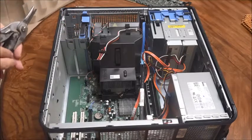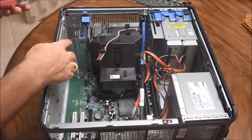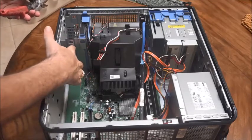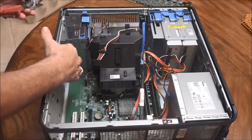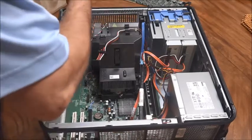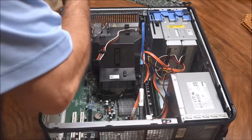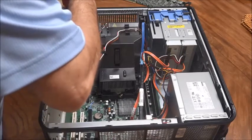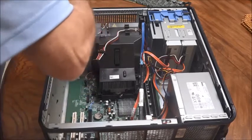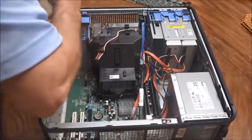Now what we have to do is cut this piece right here. We're going to cut it right along this edge because we want to free up from here to the end of the case. We're going to go ahead and cut that just like this with the tin snips — make sure you get the red ones because they're left-cut.